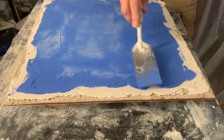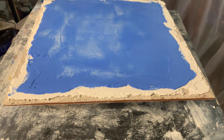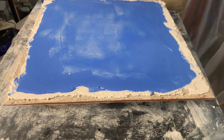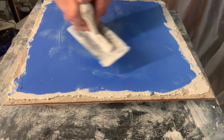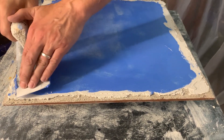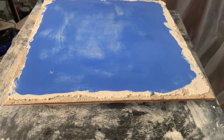This is where the painter in me comes out, because I just like to use the trowel like a palette knife. Pigment particle size is very fine, so if I get this thin coat of pigment plaster too thick, it will crack — there's not enough body to keep the lime plaster from shrinking beyond a certain point. That results in a crack.